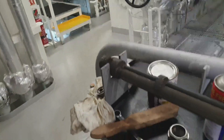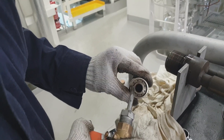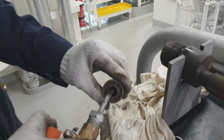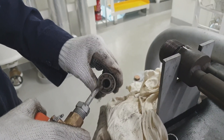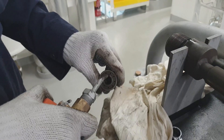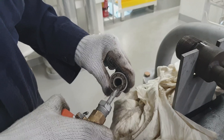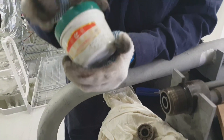Just to remove the carbons, and of course use compressed air. As you can see, in the atomizer it is composed of a combination of holes for the fuel and the steam side. Just use high-pressure compressed air for cleaning. This is the diamond compound, or lapping compound, which is 1000 grit.